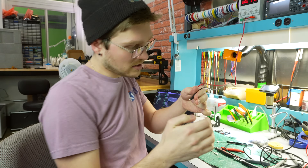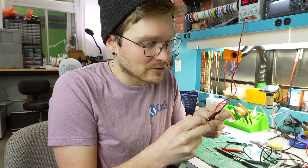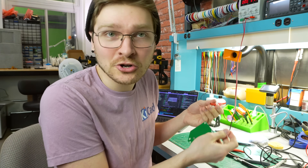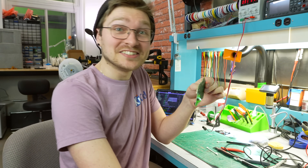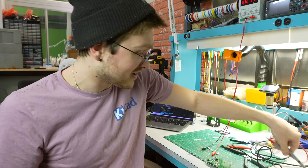I could try and power this just like how you power any other feeder by mounting it onto a rail on a Lumen. But when it's a new board, I like doing it on the power supply so I can inspect it and probe different voltages. I just soldered a couple little jumpers so I can connect it pretty easily. Nothing feels hot — that is excellent news. 3.3 volts. There's our 10 volts. We are in good shape here.